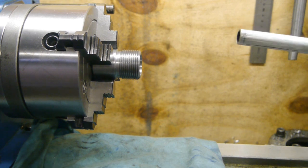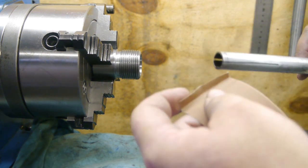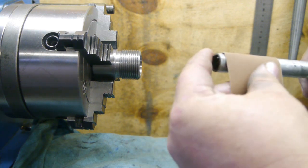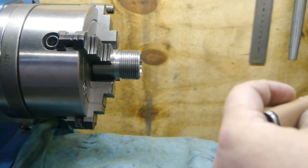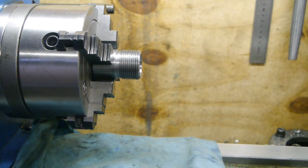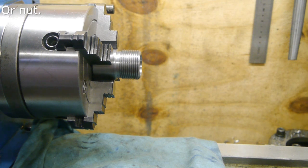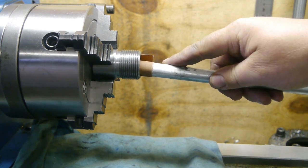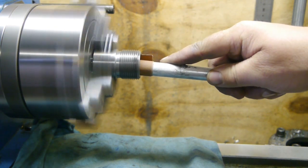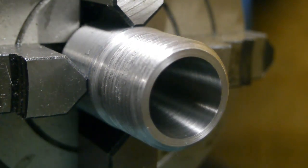This is what I came up with — it's a piece of central heating pipe. I cut a slit in it and I'm going to use it to hold a piece of emery cloth. I did a pass with 180 grit and now this is 540. It's important to polish this bore very smooth because the collet is going to slide on that when you tighten the cap. I use a little oil — it keeps most of the swarf in there. Just try and keep it as parallel as possible to the taper. That looks and feels pretty good.